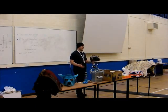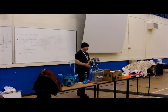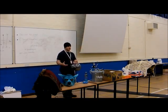That way, when you come to do your prime thing that you're going to wear around a convention or whatever, sell on eBay. If you do it, and then you go, right, okay, I'll take the mould off, pull the mould off, and the mould just splits in two. You go, shit, okay, it was a really bad pull. It's going to cost you a lot more money, of course, but you can go back to your master, your master polyurethane you put in your box, and it's all safe, and it's got no scratches or dust or rubbish on.